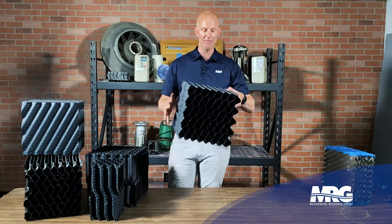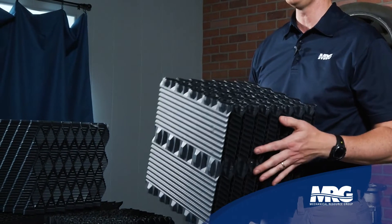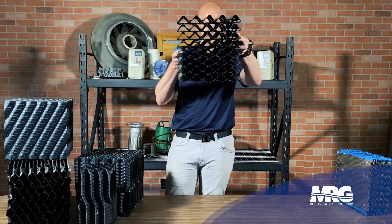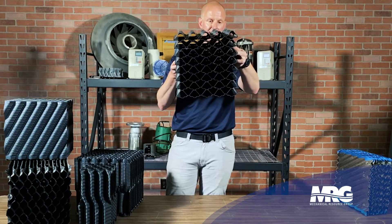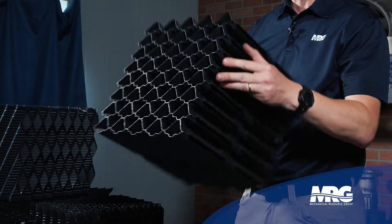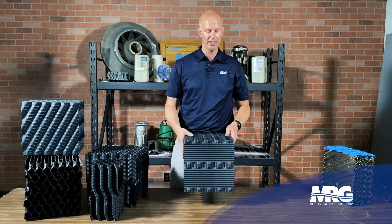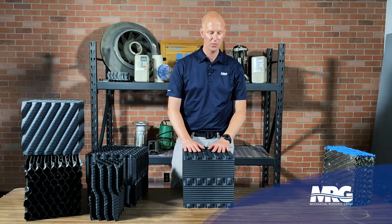You can also discuss how fill should be installed back into the cooling tower. This one is a really nice one — you have over a one-inch diameter opening and it's straight down. This is probably my favorite for really dirty tower water.